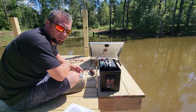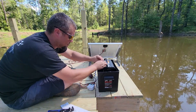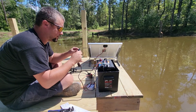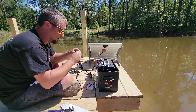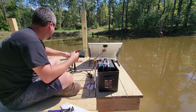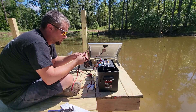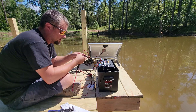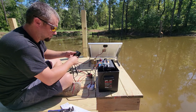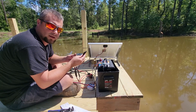This set of wires goes to the center wire on the solar panel controller — that goes to the battery. You got two lights on and you're supposed to do that one first, then hook up the solar panel to the controller. Now it should be charging the battery — yep, got a charging light. This extra set of terminals is what I'll hook the LEDs to.